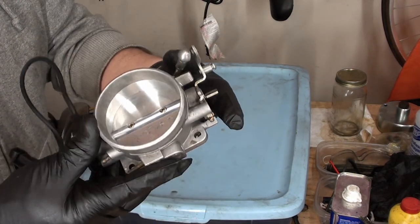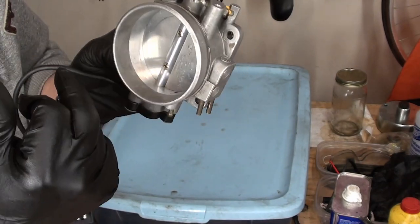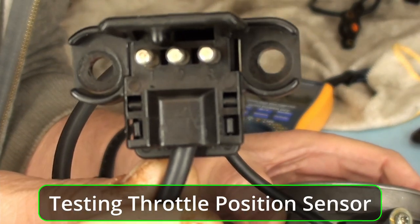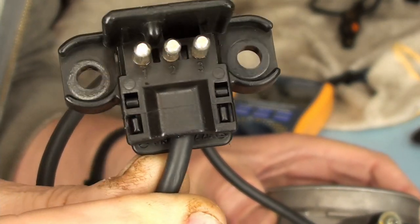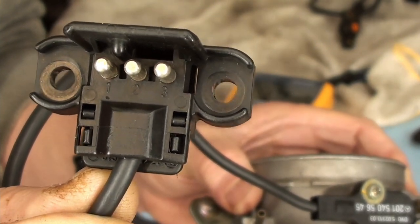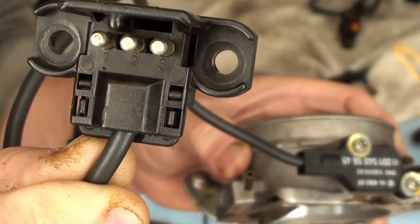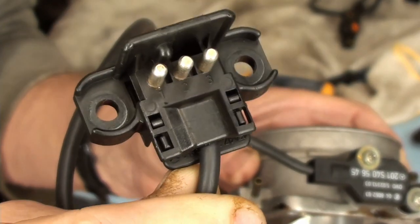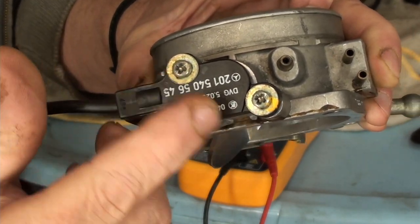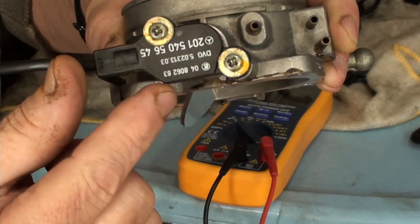So it's all washed, but now it's got some discoloration right there — but I don't think that matters at all. Now this is labeled pins one, two, and three. Two is in the middle and number one is on the left when you're holding it upside down. We're going to be working with those two. That third pin is probably the current that comes in — probably five volts. It's a position sensor, and when things have yellow on it, that's saying 'don't touch this' — but we have to check it.